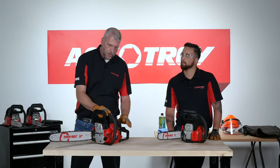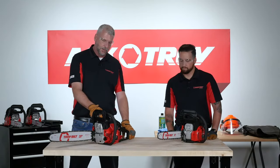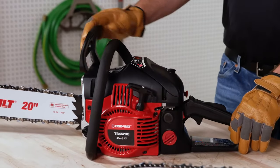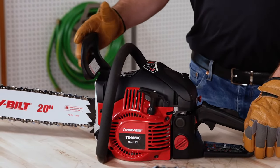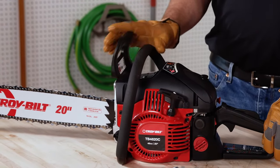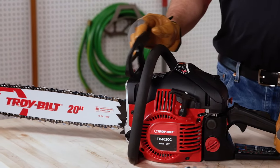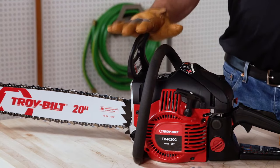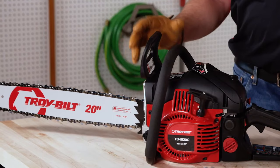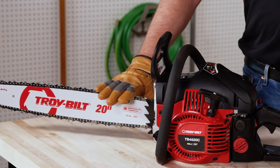The other steps involved in starting the chainsaw are about the machine's settings. The chain brake, right up in this area, when it's engaged you'll hear a loud click and it's stiff — it's unmovable. In normal operation it's pulled back and very flexible. The chain brake is a safety feature: if a kickback were to happen, this chain brake engages and stops the saw blade immediately.